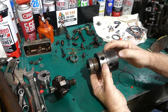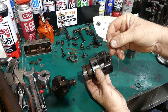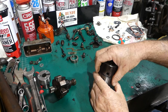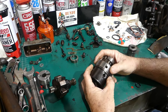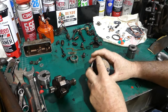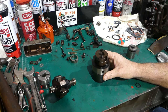If you have the pump leaking around the body where the injector lines come off, that's this tiny little O-ring — big in diameter, very small in section. All we have to do is roll that down over and sit it in that little groove. Just remember, we're resealing this pump, not rebuilding the world — we believe it's working well from what we can see.